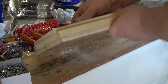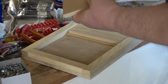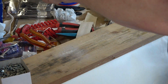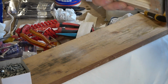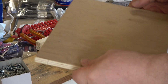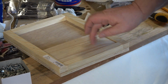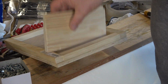And then we're going to make our shutter, which goes up and down in that. We've already made the lid, if that's what it's called. So then we'll have a sandwich like that. It's like Blue Peter, isn't it? But I haven't got one that I prepared earlier. So I'm going to screw this together. It's going to be glued and screwed, and we'll use modern PVA adhesive between the strips. I won't glue the top surface, we'll put a gasket on that so that it's got serviceability.